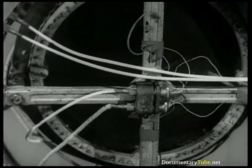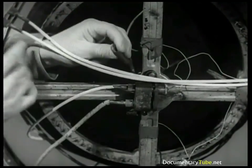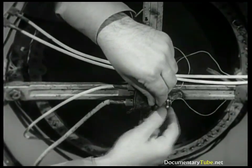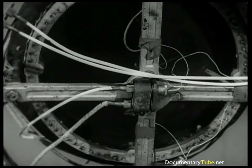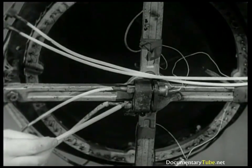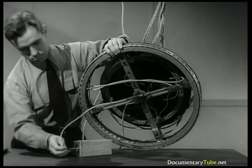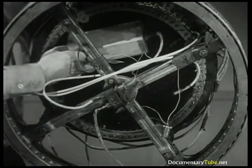The payload is passing through a T-hook and suspended from two blowout plugs in the bottom center of the ballasting ring. When either plug blows, the T-hook is released and the payload falls away. The blowing of the payload plugs in the number nine circuit also ignites the fuse leading to the demolition block. On some balloon units recovered, the demolition block has been found not beside the battery on top of the aneroid box, but within the ballasting ring — the logical place for it to do the most destruction to the unit. This region is also a good location in which to look for booby traps.